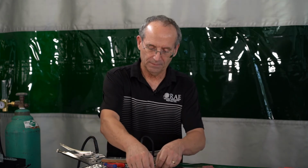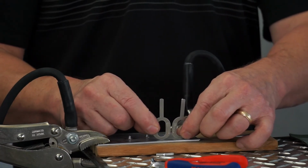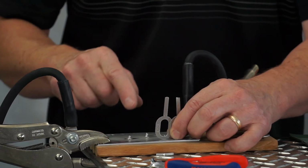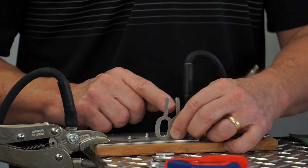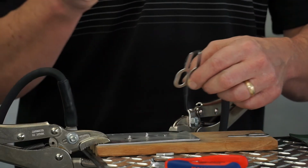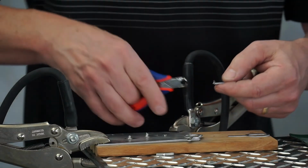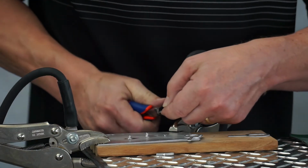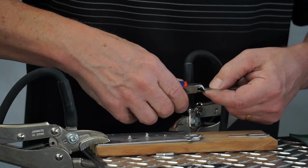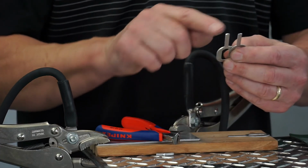So after we have put a key on the panel, cut it off, this one is brand new. We can see the difference in the keys. If you look at the end of the tab, it has a very slight roundness to it, not a sharp point. You can end up reusing these keys probably up to about 3 times. Once they don't stick out past the black tip of the tip holder, you can't use them anymore. But the easiest way to trim these, take the cutting pliers and just go straight across. And then we're just going to take a little bit off of each corner, not make it a really sharp point, but that will actually weld on just as well as the factory point.